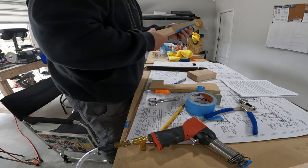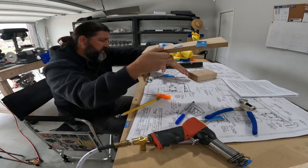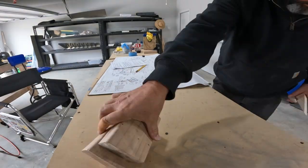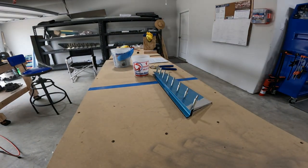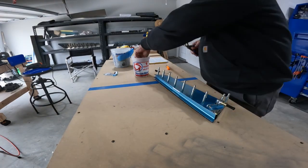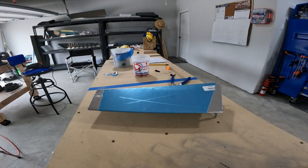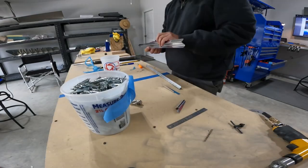Once the bending is all done, we have to put together the little baby spar for the trim tab. You'll see me clamping that baby spar down to the edge of my bench and actually drilling some holes and cleco-ing it to the bench. It's a weird little Z-shaped spar and one portion needs to be machine countersunk because it mates up to the piano hinge that will connect it to the rest of the elevator. Those are the little brackets that will attach to the servo motor, and there's the piano hinge — test fitting it.